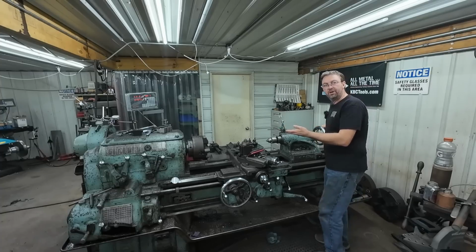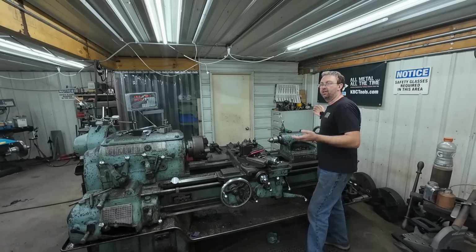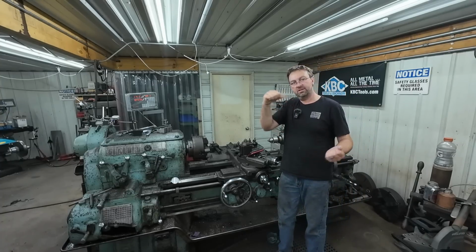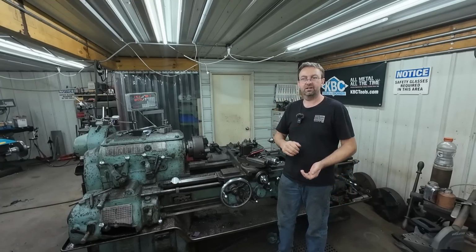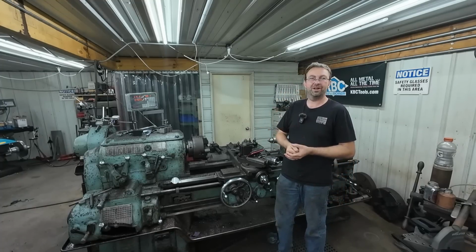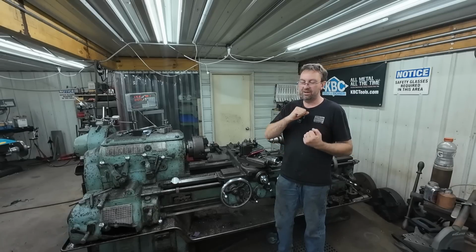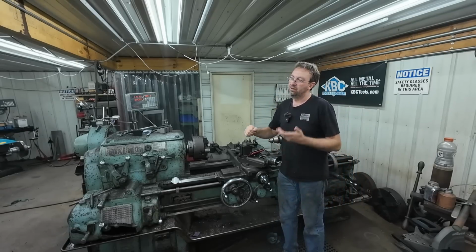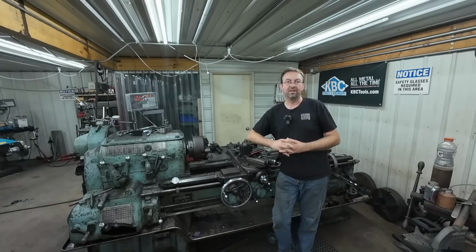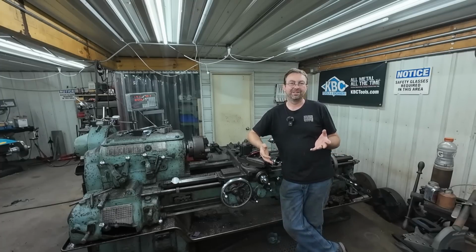You start to load up on chips and then you got to back it out. On the radial drill, flip of the wrist, spin it out, spin it back. Lock it in, feed until you hear the chunking going on, which you guys could hear in the video. Flick of the wrist, spin it out, spin it back in, away you go. And the drilling went really fast. And there's another one. A lot of you commented the same thing.